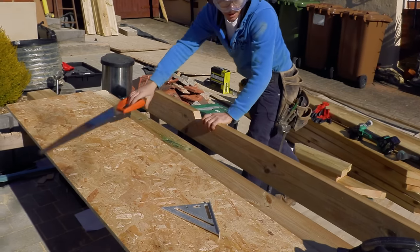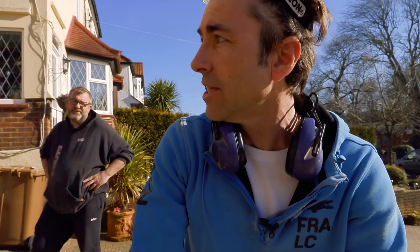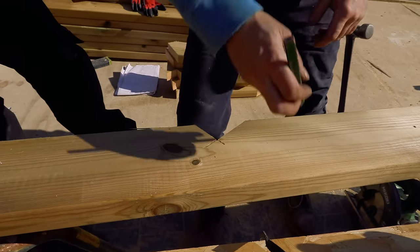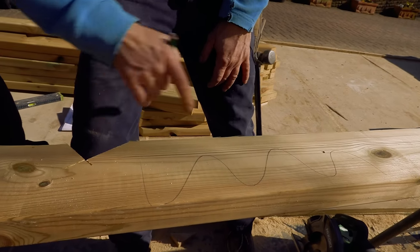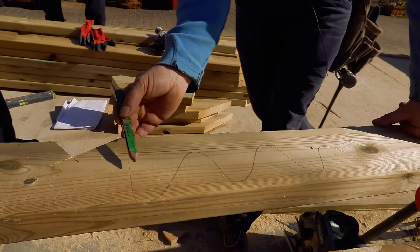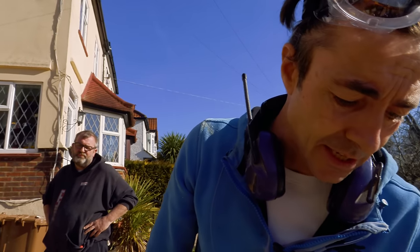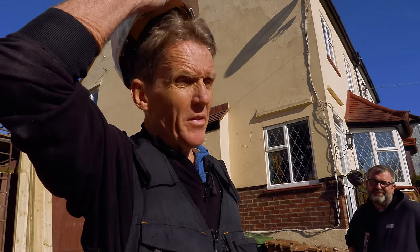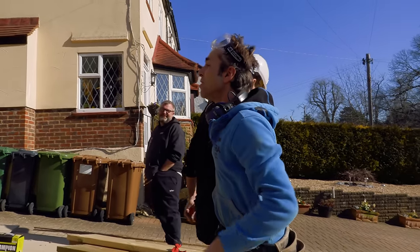That is effectively our rafter, and this is indicating the wall plate. This is an oversized rafter structurally for what we're doing — look at the span, it's nothing. The reason we're doing this is to accommodate PIR — 100mm of insulation — plus airflow underneath, on the warm side with insulation and airflow over the top. You'd use a breathable membrane or a vented fascia board, or counterbat. Let's get on with it.